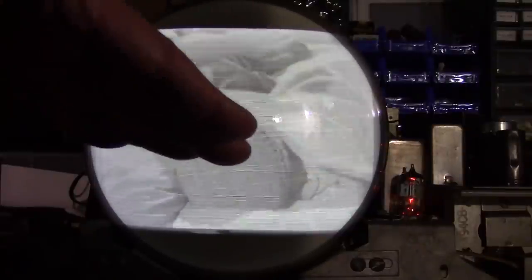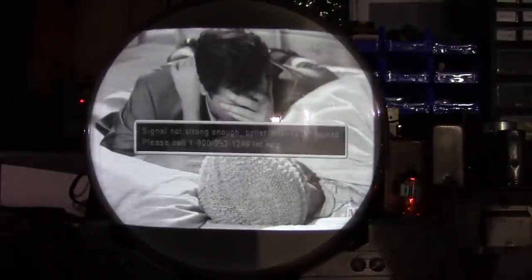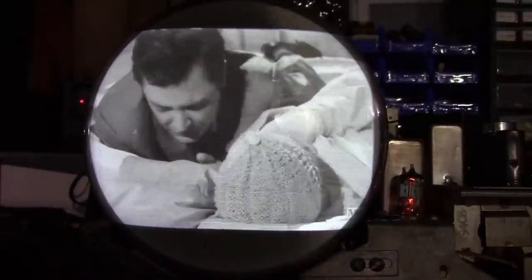On a weaker CRT that you're driving a bit harder to get a watchable image, they become more noticeable, or if you're receiving a weak signal. Those are pretty easy to get rid of by picking a signal off of the vertical circuit and blanking out the CRT during a retrace interval. The other is DC restoration, which I'll try to explain in a moment with some diagrams. I'm hoping to illustrate the problem.